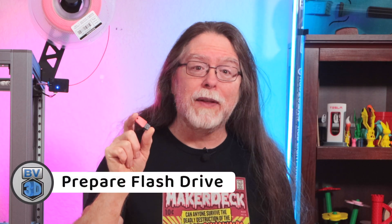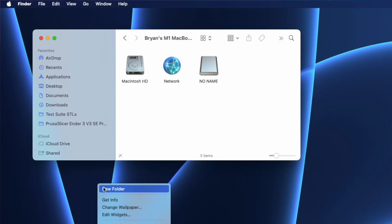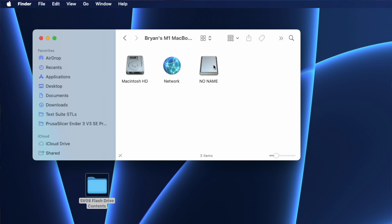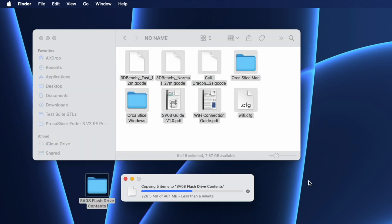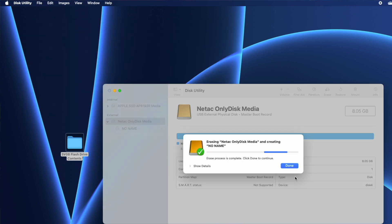Now I need to prepare the flash drive that came with the printer so it can be used to perform the update. So I'll plug the flash drive into the computer. Sovol's tutorial starts with 'after the Udisk is formatted,' so I'm going to have to format it. But since formatting it will delete all the files already on it, I want to back up its contents to a folder on my desktop. So I'll make a new folder on my desktop and call it sv08flashdrivecontents, then copy all the files from the flash drive to that folder. It needs to be formatted as a master boot record FAT32 volume with 4K blocks. I've got a video about how to format microSD cards for 3D printers linked in the description, and you can use that as a guide for formatting the flash drive. I'll format it using Disk Utility since I'm on a Mac, but on Windows you'd right-click the drive and format it that way.